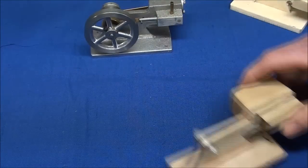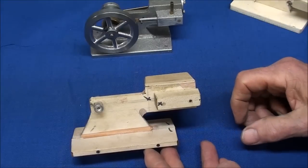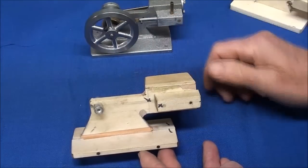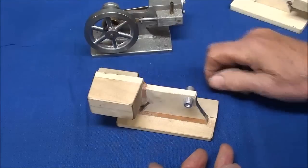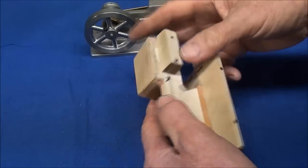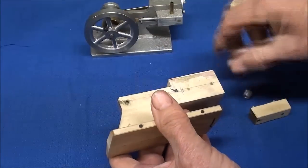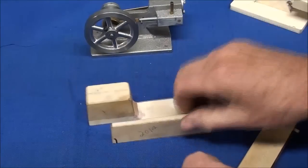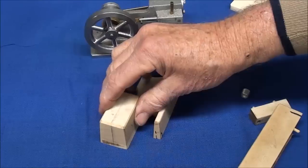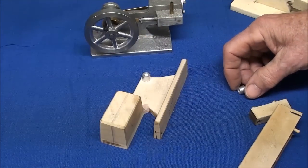After doing that, I made the actual foundry pattern. This is the pattern itself, and I made it quickly because I didn't think I would be making more than one or two castings. In fact, at this point I've made three castings, and I may never make any more. I do not like to put a lot of time into a foundry pattern if I'm not going to make a lot of them. This has some removable parts — I needed the parting plane. All these parts came apart, and this is a flat-back pattern. It is much thicker than I would like right here, and when you have a real thick part in your casting, there's a tendency for it to shrink and have a shrink hole — that's just the way it is in the foundry when the metal solidifies.